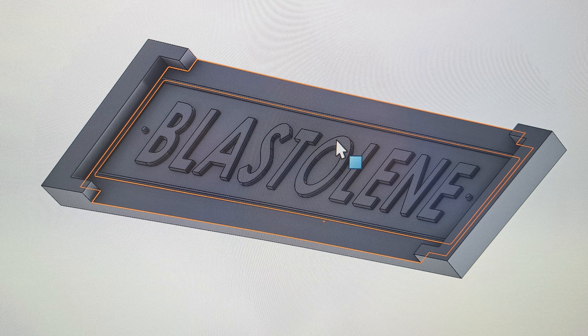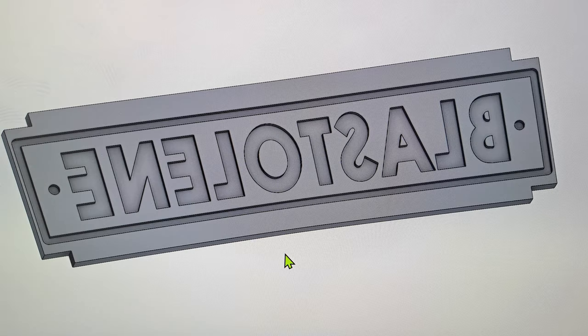So what I did is I printed out his logo, one of a base, which is basically the impressions we want to stand up, and then one with a negative, which is the impressions that we want to stamp down into it. I'm gonna use the shop press for this, and we're just basically gonna cut down some pieces to size. We're gonna test it out, see if the 3D print is strong enough.